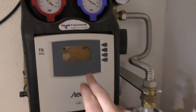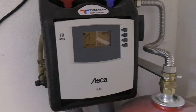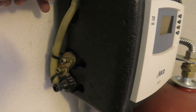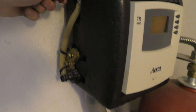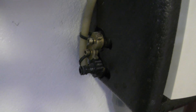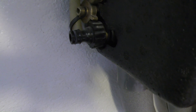There is a little bit of water down here because I spilled. I need to remember to get the mattress out of there. It lifts over here — a very old mattress that's more or less only used for fixing my solar panels. Right now it's saying 60 degrees up on the roof and 40 degrees down here, so the top-up might have helped. There is also a small bleed screw on the side to take out the air in the system down here — I'll turn that gently with a little hose running down, and when the fluid starts to come out I'll shut it off again.